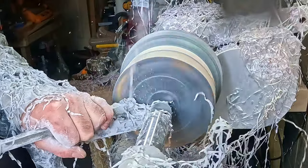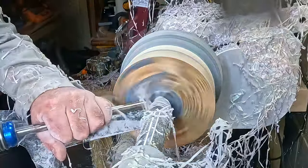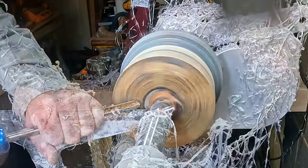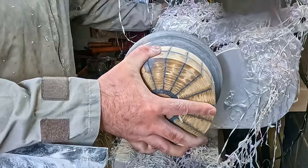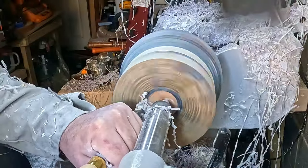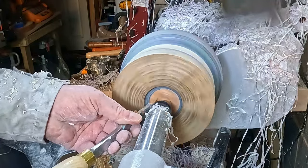Removing all the waste resin let me see the center core and re-mark the center if required. With the core clear of resin I could see it was off center, so I removed the blank from the lathe, re-marked the center using the core as a guide, and refixed it. The wobbly joints were much better - not perfect but good enough. I cut the mortise using a quarter-inch parting tool to a depth of around eight millimeters, then cleaned the waste from the inner part and sanded the underside with 80 grit.